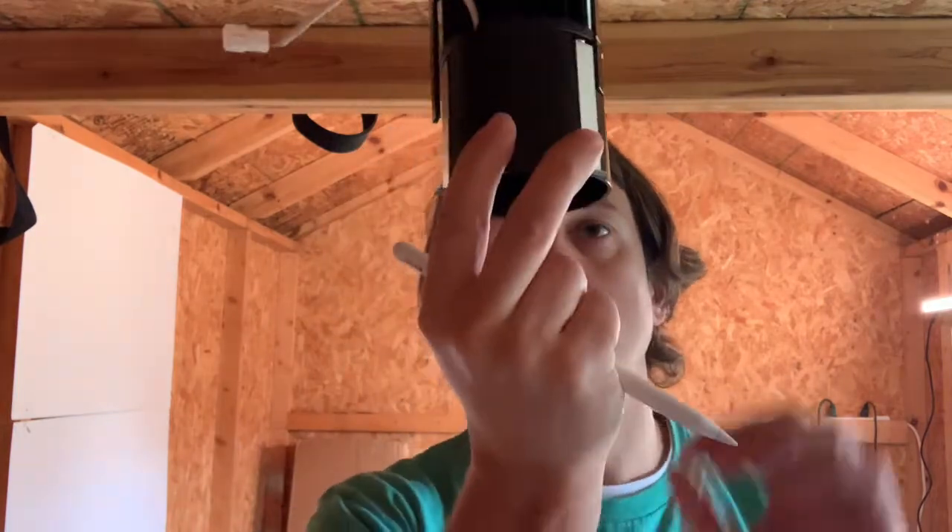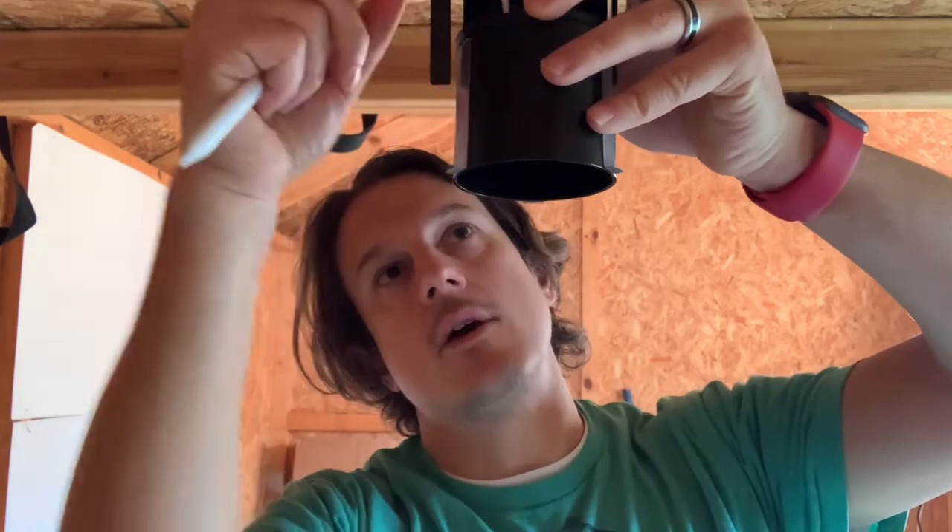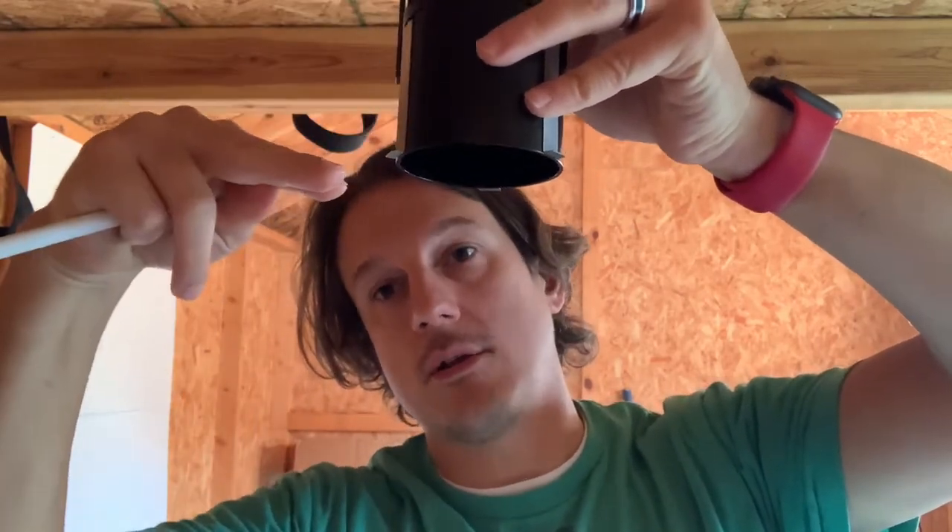These wings are going to close. You take your hole saw, bore a hole up into the ceiling, this slides up, and then you use your screw gun to drill this down and these wings will slide down and push onto the ceiling to hold the light in place. You've already put your driver up in the ceiling and you're making your connection with this little low voltage whip.